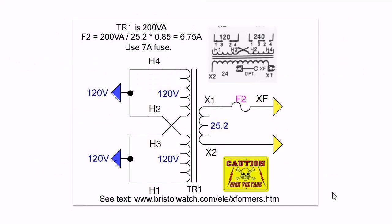Let's look at the first connection. I've connected it for 120 volts — remember it has two separate 120-volt windings. By wiring them as shown on the plate, I have connected H3 to H1 and H2 to H4. What this does is put these transformer windings in parallel with each other, and they are in phase. If you were to reverse-wire it — say, connecting H1 to H4 and H3 to H2 — you'd blow the transformer. You have to wire it this way for the two windings to be in parallel, wound in the same direction, and in phase.